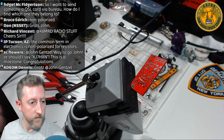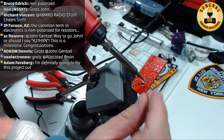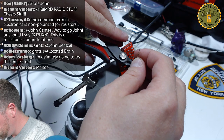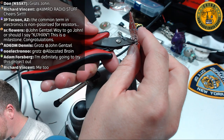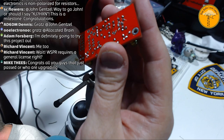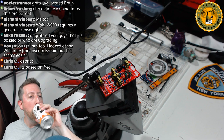Let's solder them up. After soldering, always look for bridging — that's where solder has kind of joined two components together — and just wipe it clean. That wasn't a bridge, but I wanted to make sure. Pause for a sip. Congrats to everyone who just passed or is upgrading their license.